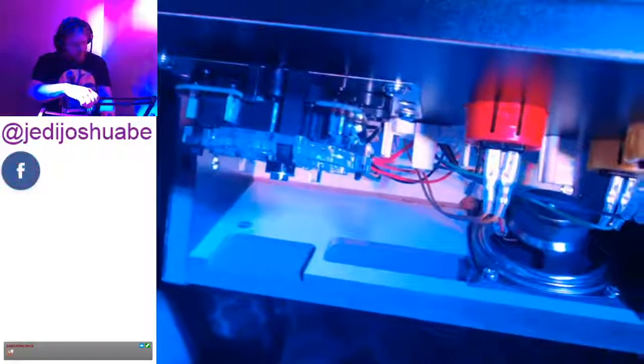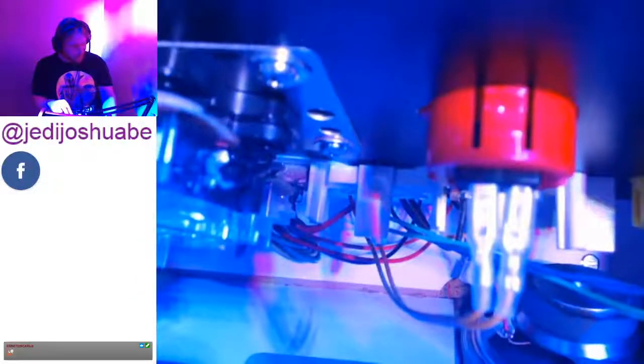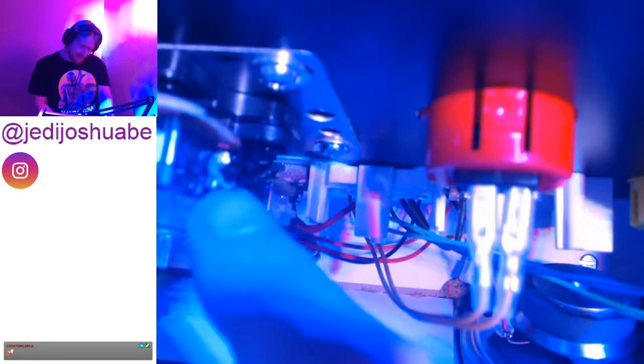All right, and then so here's our connection here, this weird 4-pinner. We're going to slide it back, and we're going to do one more nice view shot here. We're going to bring it in tight, and we're going to see. So there, this is the modification that has to happen. You have to solder directly to this. This is a solder resistant material. You have to snip into the post. You have to disconnect the post by snipping it, creating this gap. You can see that light underneath of there. And then just smash it in there and get it to fit on there.